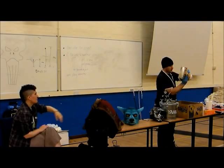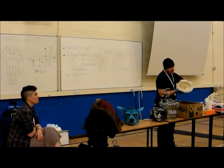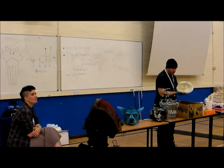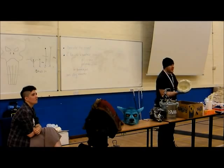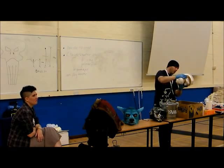Are you going to steal a little bit of that for the other mold? Or are you doing a third batch? Yeah, always do it in layers. Don't think, I need X resin. If you're doing fill, just fill it up. If you're doing roto, don't go, right, okay, I need that much to make a mask, mix a great big litre batch, dump it in. You're better off doing two. About two layers is usually fine, but it depends. I do three. You do three.